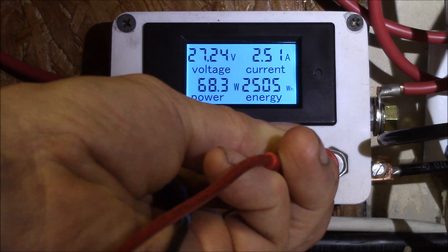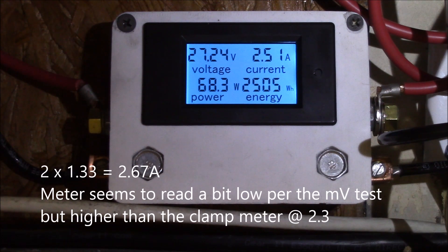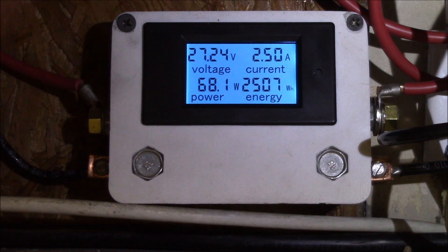The two ends of the shunt will have a few millivolts across them — right there I get 2 millivolts. Multiply by one-and-a-third and that's about right: 2.5 to 2.6 amps. So I think we're in the right ballpark now. The other problem was that while working with the two shunt pickup wires, I must have worked one of them loose.